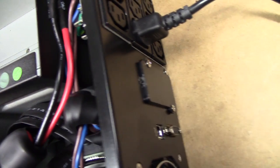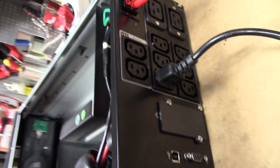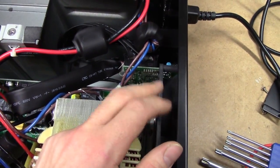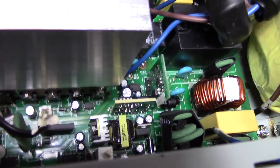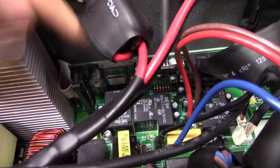We've got a USB board there — a communications board on USB. Nothing really too fancy going on, not that we could see anything. This is our smart slot equivalent. I think these support two or three output zones — we've got load zone 1 there and load zone 2 there, so that's a nice feature. I'm not certain if APC offer anything similar in their same size units. One of the things I don't usually like about these Dell and often Powerware units is that they run the fans continuously all the time — they don't run at full speed, but you don't get any passive cooling whatsoever.